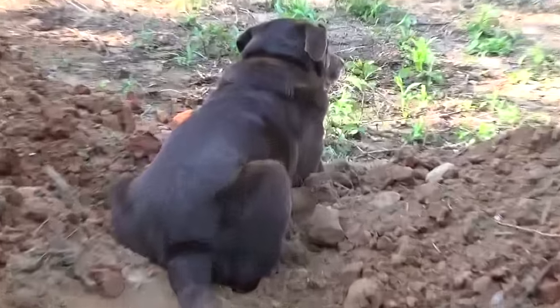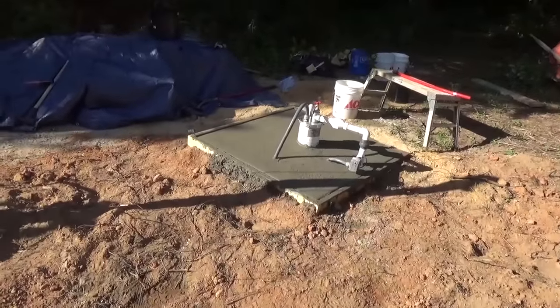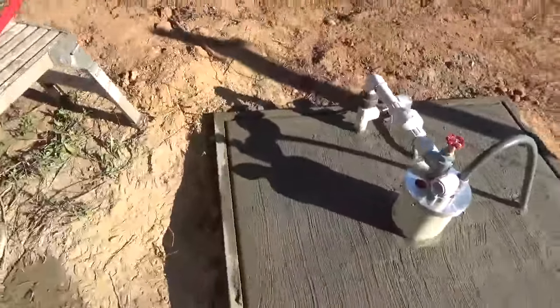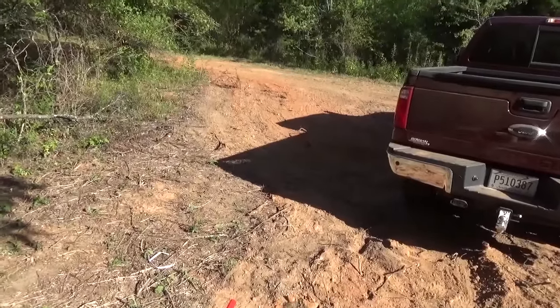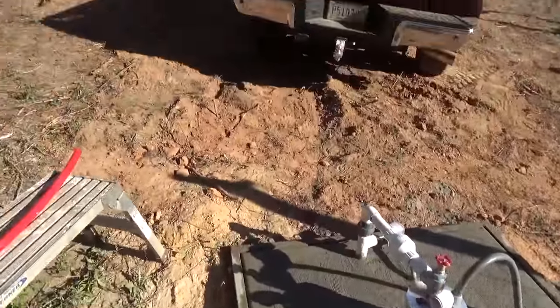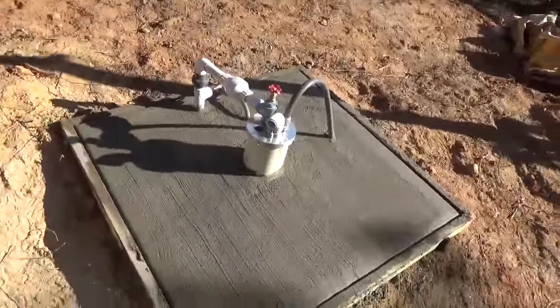End of day number two — we hit a hundred degrees around three o'clock, so it was a good time to start mixing mud. I don't know why I end up doing these water projects when it's a hundred degrees, and then of course because they're solar water projects they're in the location of good solar. I'm a little loopy after two days of this. I've got my trenches dug, I've got the pipe buried about three-quarters of the way up the road. I've got a thousand feet from the well to the cistern and I probably made it about 600 feet today — buried, backfilled, and graded.